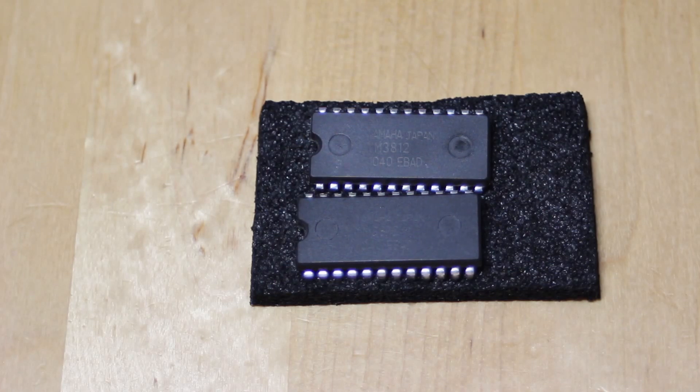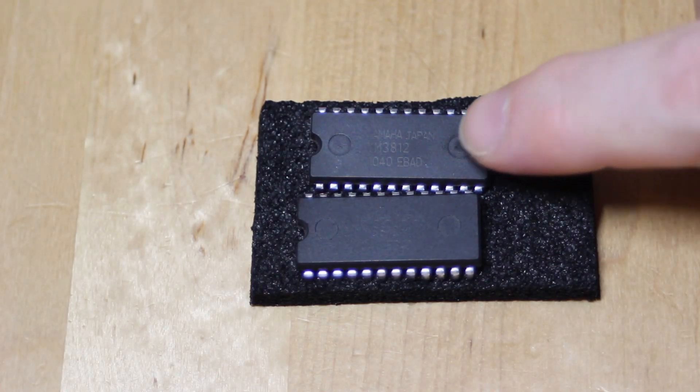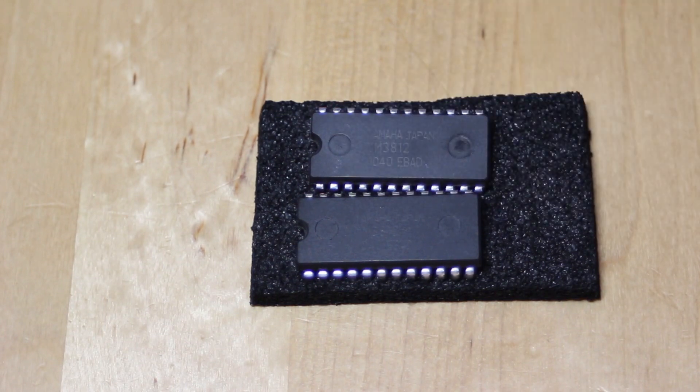These chips probably haven't been made since about 1994 or so. On the other hand, I can find these kinds of chips with dates from just about every year since 1994, so it is a little bit hard to say for sure that they stopped production, but my suspicion is very strongly that they have. The other indication here is that there seem to be some kind of black material in these holes — those should be shiny. This is where the plastic has been extruded from the mold, and those really shouldn't have black gunk in them.